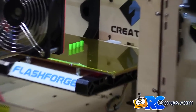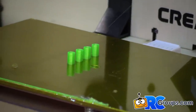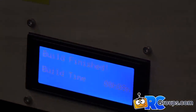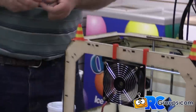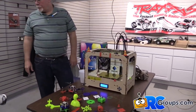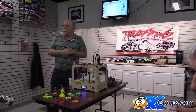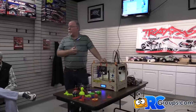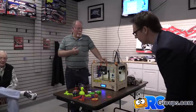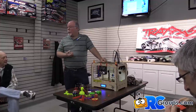The spacers are done — about eight minutes. Now we have four spacers. Getting prints off the bed can be interesting. Q: Any other consumables besides the plastic? A: Just when it breaks — you could print for a couple of years realistically. The motors will break, the belts will break, the extruders will eventually clog up and need cleaning, and the hot ends can get clogged and need replacing. But otherwise they're pretty reliable.